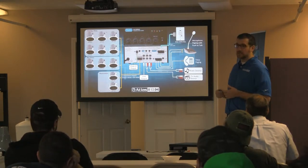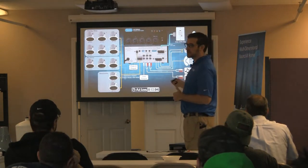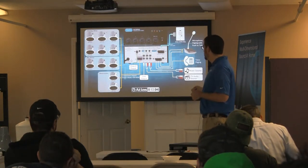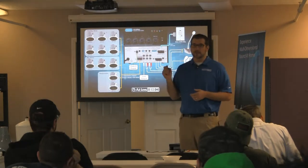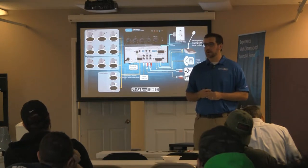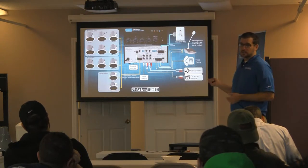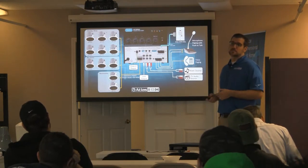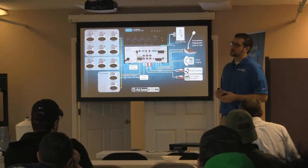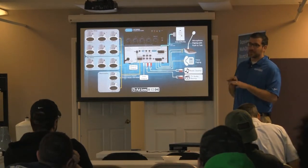You don't need to have all of them tapped at 8 or 16 for the system to work. You can have multiple taps on the transformers as long as the total wattage does not exceed 80% of what the amplifier can handle. This is a typical restaurant — could be Chili's, O'Charlie's, or whatever. The cool thing about this amp is this little remote plate — it gives you remote input selection and volume control. If the rack is locked in the manager's office and it's busier at night, you can set this wall plate up to 200 feet away using standard CAT5.